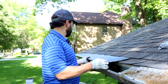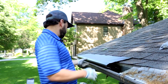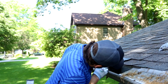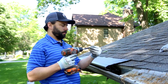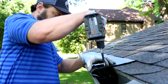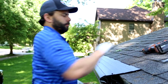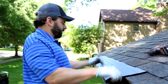Tuck the panel under the second row of shingles, snap it into that clip, snap it into that clip, and now you've got a nice secure connection. Color-match zip screws ship with the panels. That's half a panel in and it's completely secure — I can just wrench on this thing.